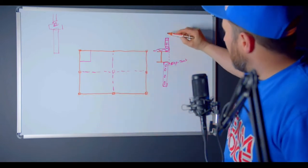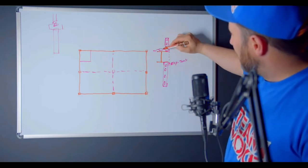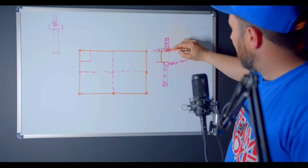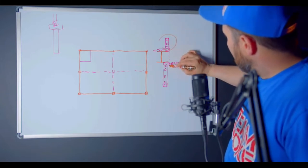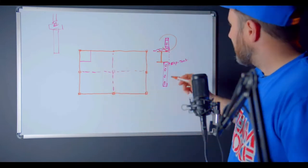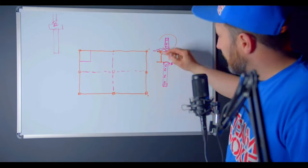So remember for the roof, there's always parapets. This is your roof here, Q deck, and then you'll have your parapet at the top here, and then this is your wall. You have to make sure the drywall will be nice and flat all the way up, all the way around. So when you're laying it out, check from corner to corner. Always do a quick check.